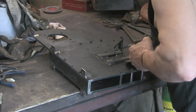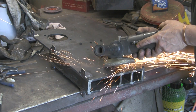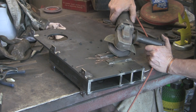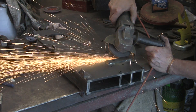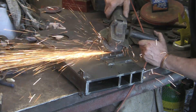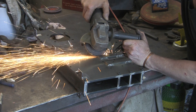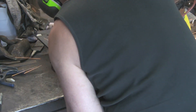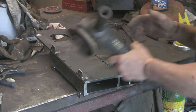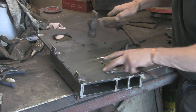I've just got my slitting disc - I'm going to cut into the weld and try not to cut into the base metal. Obviously sometimes it's unavoidable and you will nick the base metal. I'll tell you what, whoever invented these little slitting discs - bloody marvellous things, really handy for all sorts of little jobs like this. Let's give them a tap and see if we can get it off. Yep, look at that - straight off, nice one.